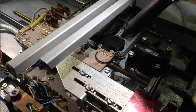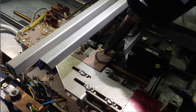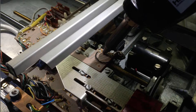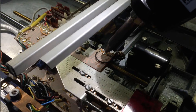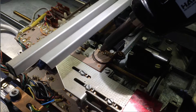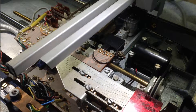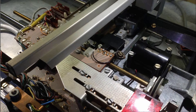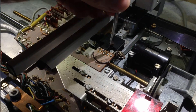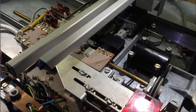The first step is to unsolder the light bulb. It's good to use a solder gun. It's a little bit difficult because of the angle. Now it's time to take out the mounting screws. Now we can take the light bulb out. In my case the light shield here was not glued to the light bulb body, so it came off separately.